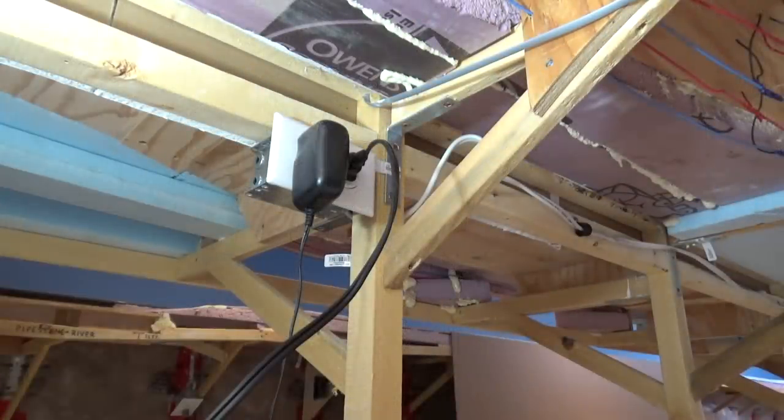So just a quick note about the power supply for this control panel. I had originally run a 14 gauge bus with 12 volt DC right off my 8 amp power supply, the big computer power supply that powers this booster, if you remember from previous updates. Anyway, it's way too much power. 8 amps is way, way more than you need for tortoise switch machines. And on the first switch I did, the resistors on the LEDs were getting super hot. I ran it by my brother and he said, yeah, that's probably not a good idea. You need to put fuses or something if you're going to have that much current available.